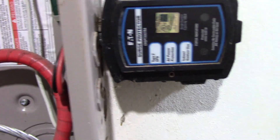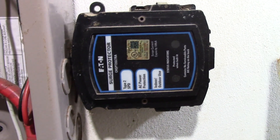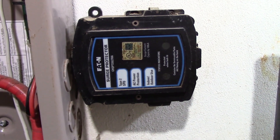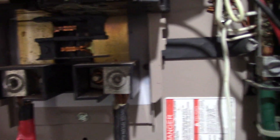That's all there is to the installation. Make sure of course you shut the power off, or be very careful when installing this. If you've got a main breaker, shut it off, or go to where the main breaker is and make sure the panel is dead when you're working in here, because it's pretty easy to inadvertently touch your knuckles onto those hot lugs or anywhere on the bus bar inside this panel.